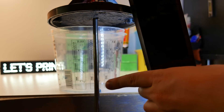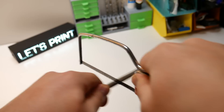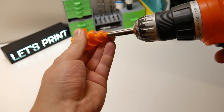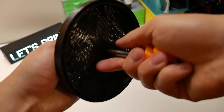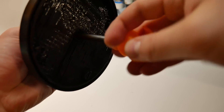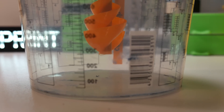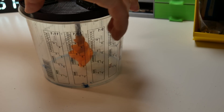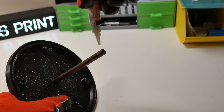Next step we need the right size steel rod — I took measurements in a really professional way. The lily impeller is attached to one end of the steel rod and the other end is connected to the coupler. But the lily impeller has to be at the right height: it cannot be too far away from the bottom, but it cannot touch the bottom either. When I got this right I did a little marking and then I glued the impeller permanently to the steel rod using some super glue.